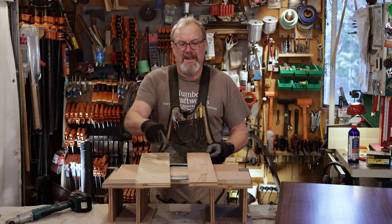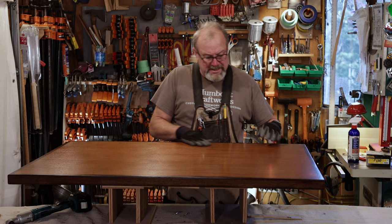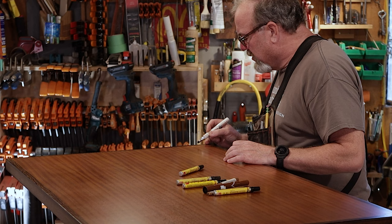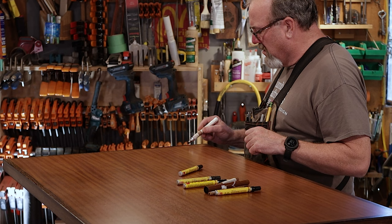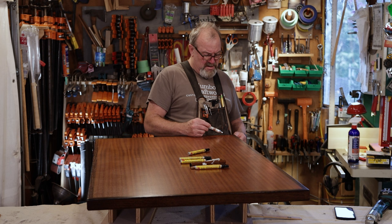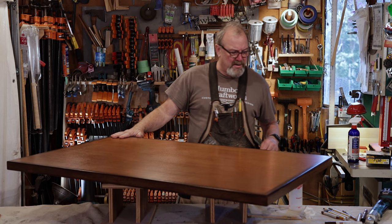I just wanted to show you what this looked like. These two little stands are screwed down to the bench with just two screws, and here's the lazy Susan right here — I just screwed on a couple pieces of plywood. Here's our wood top. Look at the color in that thing — it looks really cool, except for the burn-through. I can see quite a few of the dents and dings that I missed. See that burn-through right there? Let's see if I can fix it real fast with a pen. Sometimes you can fix burn-throughs with pens — not always. You can go with the grain just to darken it slightly. I'm doing it super light, barely touching the wood, then using my finger to kind of rub it out. It might look better than it does now — that's all we can hope for, because right now it looks like poop.